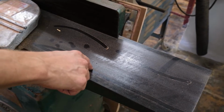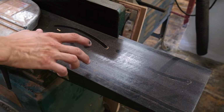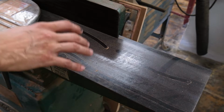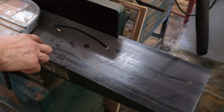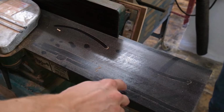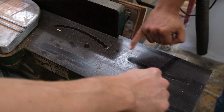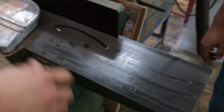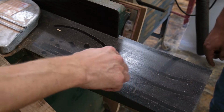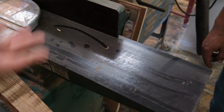And I've got 2 points on the bed, right? So the cutting is in here. Let's say this is the cutting point. So when I take this piece of wood and I scooch it by the blade, I cut off a bit, and I'm closer to flat. And then I run it through again, and I'm even closer. Yeah, okay. And then I go again, and I'm totally flat. I think I understand. If my cutting is here, and I put this on the blade like this. You'll have shaved off the majority before you even get to those 2 edges. Not even that. Because I have to start at the beginning of the blade and go through, basically I put this against the cutter and then I just roll the cutter along this curve and I don't flatten. I wind up just taking wood away and achieving nothing.